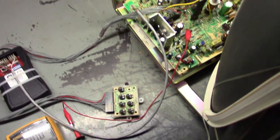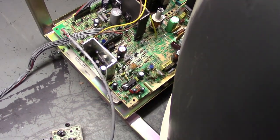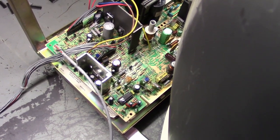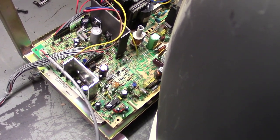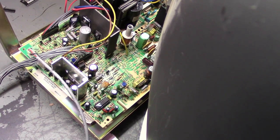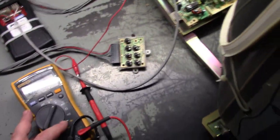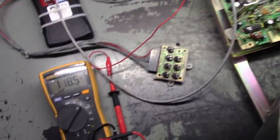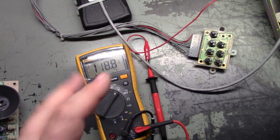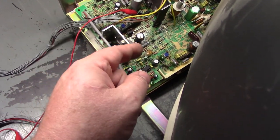Let's turn it off before we do any damage. Since our R303 and D302 and D603 were good, we've got to figure out why we're not getting our 25-volts. It could be a bad capacitor, especially since these are all original for the most part. Let's also check our B+, which should be 117 or somewhere close. It reads 118.7 - close enough, not really anything to worry about. And of course it was still collapsed, so let's figure out what's wrong in the circuit for the 25-volts.